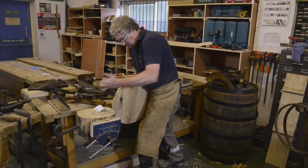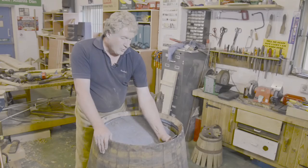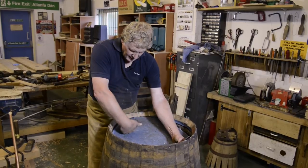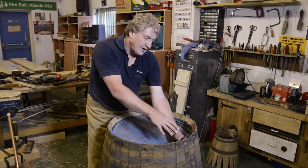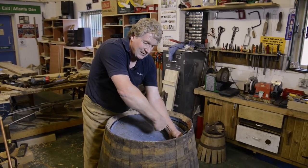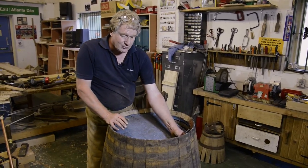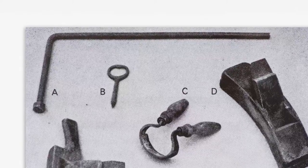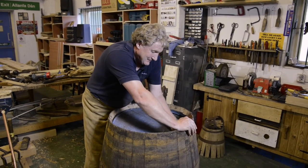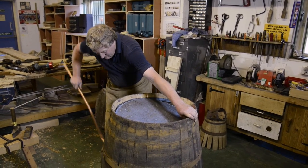What we're now about to do is put the front head into the cask itself. The head goes inside the cask, and this part of the head drops into the groove. We've got a tool called a heading vise, which is like a big corkscrew in effect. That is screwed into the head and we can use it as a handle to lift the head so it drops into the groove. If it jams, I've got a tool called a knocker-upper, which we'll use to bump up the head until it drops into the groove.